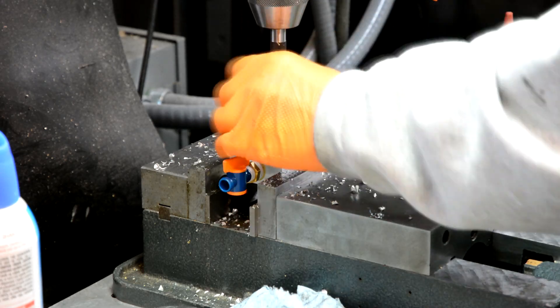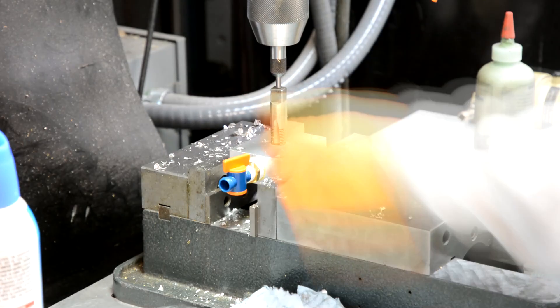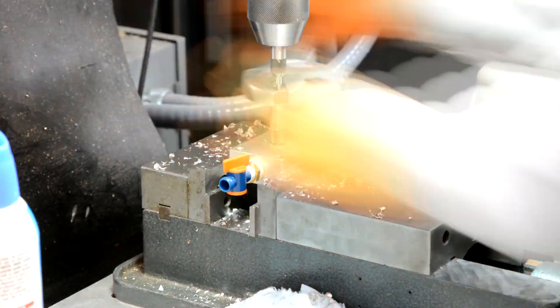How far you tap it makes the hole bigger as you go. If you only get a couple of threads and it goes too far, the problem is the hole gets too big and the fitting will bottom out before getting tight. Let's take it a little bit farther — one more turn. That should be plenty.